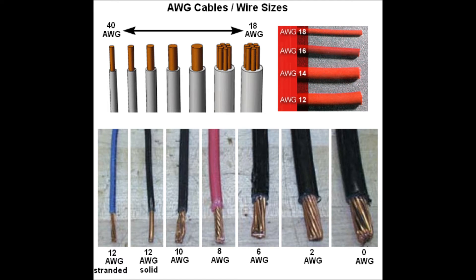Other than facing the solar panels towards the sun, the wiring is going to be the single biggest cause of inefficiency in your system. You're going to want to use the shortest amount of wire and the biggest gauge wire you can between the solar panel and the charge controller or the inverter, because the longer the power has to travel through the wires, the more voltage drop you're going to get.